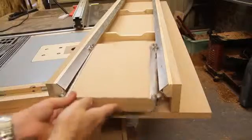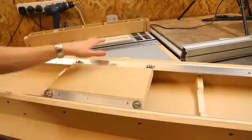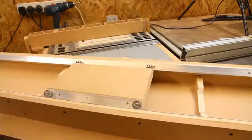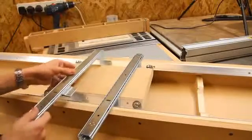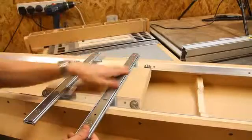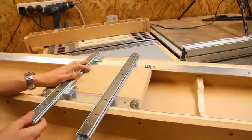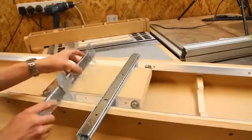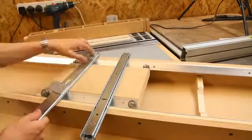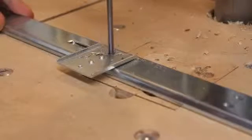It simply slides. To continue work on the carriage, what I'm going to work on next is the y direction of travel. To do that I'm using these keyboard drawer slides, which a lot of folks use for linear motion on a slot mortiser, so these should work fairly well. The first step, as I've done on this one, is to remove the brackets which are welded on — I'm drilling through the welds at the drill press.